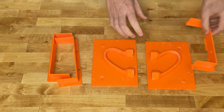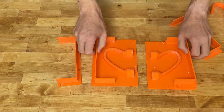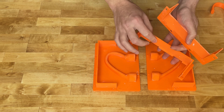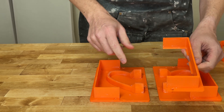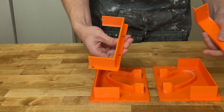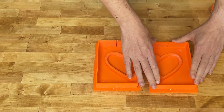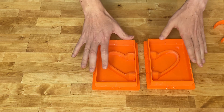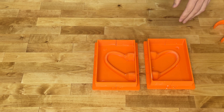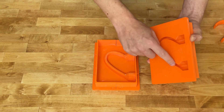We also need something to contain the plaster - there are some outer walls, these pieces which go on the back. These are actually the same across both sides. Then there are two pieces that have little cutouts for the handle piece itself. While they look the same, these are generated for each half, so they only fit one way. Then you go ahead and tape these all together. I've been using tuck tape - I can't find mine right now, it's probably in a box still. Basically you tape all the seams together, then flip it over and tape the handle in so it doesn't leak.